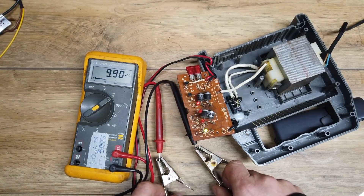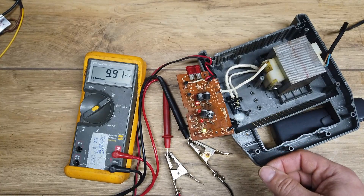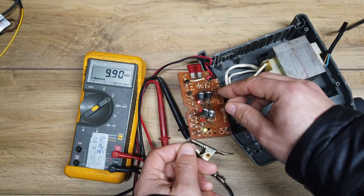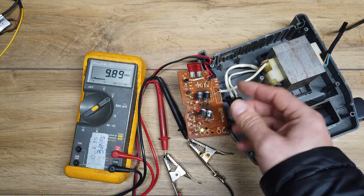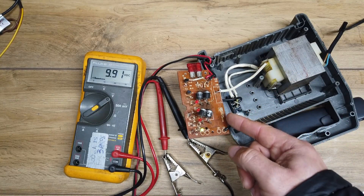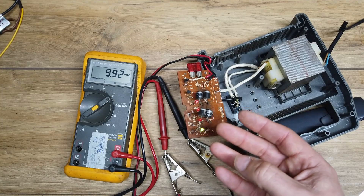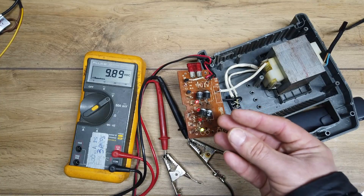Sadly, things still aren't working properly. We've only got nine volts coming out of this thing, which is quite disturbing. I'm beginning to think that strangely, the transformer may have developed a problem. In order for this circuit to generate 13.8 volts — which is ultimately what you need for charging a car battery at 12 volts — in fact, to be honest, that is sort of the cap voltage of the battery. You need more than that; you need like sort of 14 and a half volts or so.